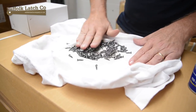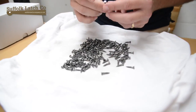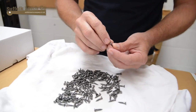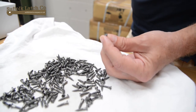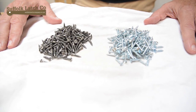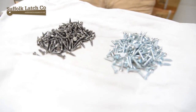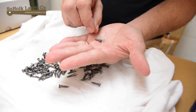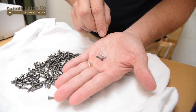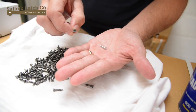And there you have it — some stripped screws. Now, if you want a slightly darker metal, I would say double the amount of citric acid and leave them for twice as long. If I show you the before and after now, you'll see this is the before and that's the after. Side by side, you can see they're quite a different colour. So that's the way you cheaply, effectively, and safely strip zinc off of screws or anything else which has been zinc-coated.